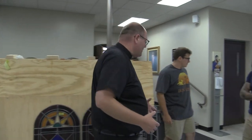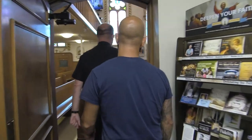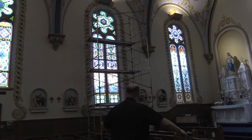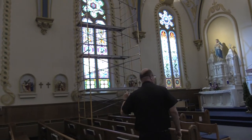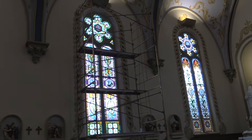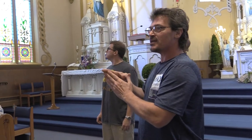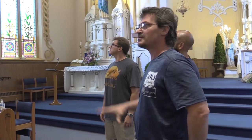Obviously we get our windows back. Now we're going to go into the church because I know you've all been waiting for this — they've gotten a few of them already back in. This is the window where the poor people sitting here would get a suntan at Mass whether they wanted it or not. They just put this one in. So how do you go about putting it in? There had to be some custom-made trim pieces and all that. We use small screws or old-style tacks that you hammer in, then you pinch the lead and go through the lead into the backstop of the window. Once that's all in, you seal it up and get your custom-made outside molding, which gets pressed against the window.